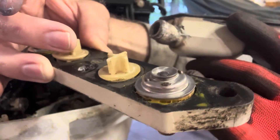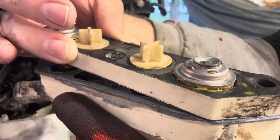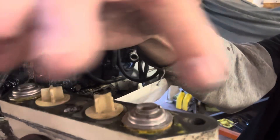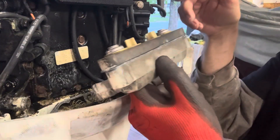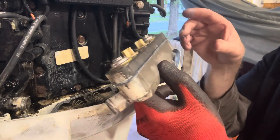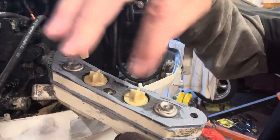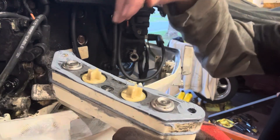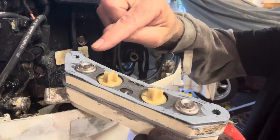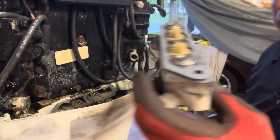I have my thermostats just stuck on with a little bit of weather stripping adhesive, and my poppet valves are nice and loose. Now we're going to put this together. I'll put a thin layer on both sides of this upper gasket. It's going to be tricky because we have to compress the springs while we're trying to get the bolts started. We want to make sure these stay free — we don't want to block them up at all, and we don't want to get silicone on the thermostats since we need them to open. The assembly has risen up a bit, but that will pinch down because there's a cork gasket in there that will compress.